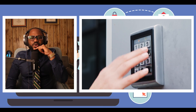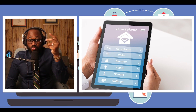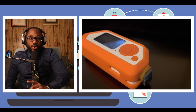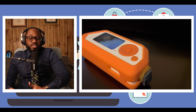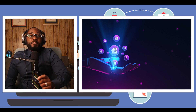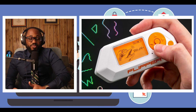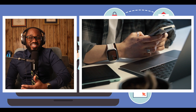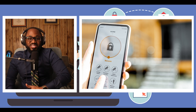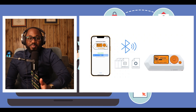The sub-1 gigahertz range is typically for smart sockets and bulbs, IoT sensors, and doorbells. The CC1101 is a universal transceiver designed for very low power wireless applications. It supports various types of digital modulation, such as 2FSK, 4FSK, GFSK, and MSK, as well as OOK and flexible ASK shaping. You can perform any digital communication in your applications, such as connecting to IoT devices and access control systems. Flipper also uses 433 megahertz to communicate with other Flippers, so you can make some cyber dolphin friends.